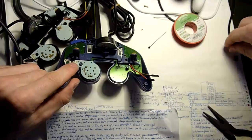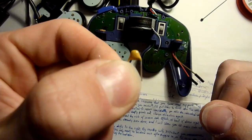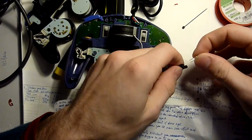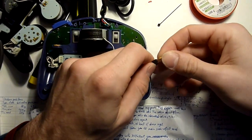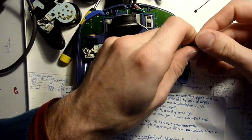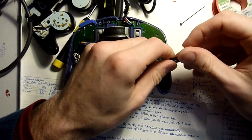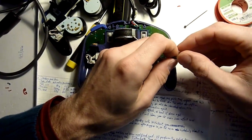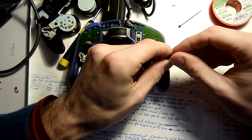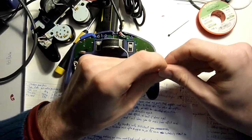Finally, we put in the capacitor. Here is our ceramic capacitor, and we just slide its legs into the female jumper wires. Here I'm using a 1 microfarad ceramic capacitor, which always eliminates all of the snapback, regardless of controller condition. On some controllers you can use smaller capacitors with 100 to 700 nanofarad, but I don't recommend doing that unless you have an oscilloscope to measure snapback accurately.